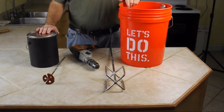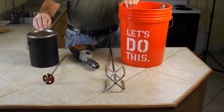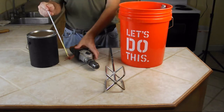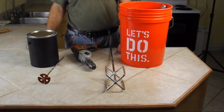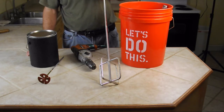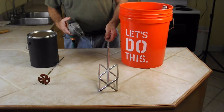Let's move on to mixing paint. Mixing paint is very important. Try to keep very good control of your containers — keep the tops wiped down, and when you're done with them, rinse them out so that if you get a bucket or lid that was destroyed, you can transfer paint into that container. You want one of these mixer attachments for gallon-size buckets — it fits on a drill. Go slow and you'll mix the contents super well, much better than a stirring stick. When you're dealing with five-gallon buckets, use a heavier paddle. You'll also need a heavier duty drill for mixing five gallons of plaster.